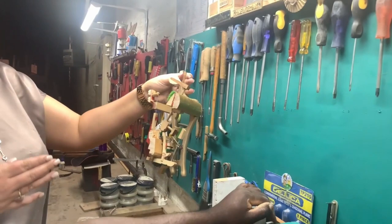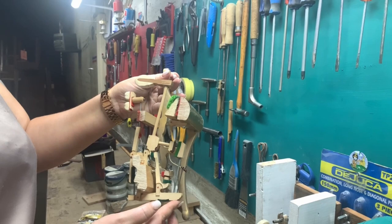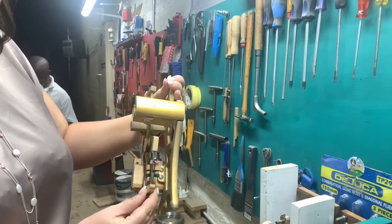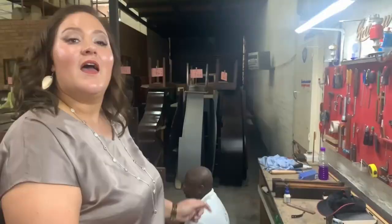The display shows all the moving parts — and what Solomon does before hammer refacing is tighten all the small screws. A piano has quite a lot of screws. If you look at just one specific key, you can count several screws and components that must be tightened. That's what he does before he starts with hammer refacing.